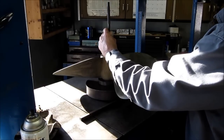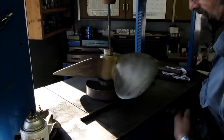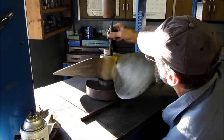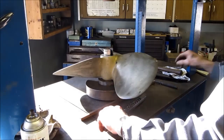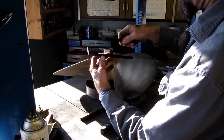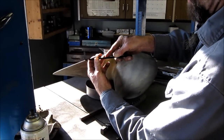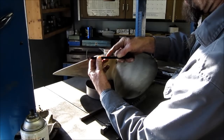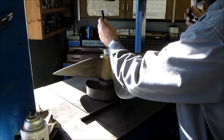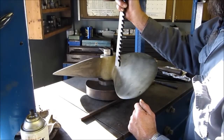You want to get a substantial pusher to finish it through. Now we add in a shim. This material is normally thinner than a standard shim, so sometimes doubling them up gives you almost exactly the thickness of a single shim made in the kit for broaches. Those just slip in the back here and they're moving your broach out to the next cut depth.